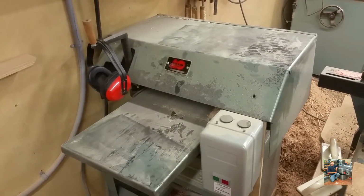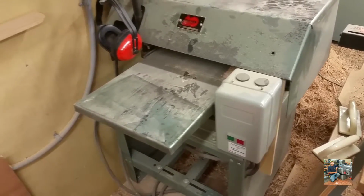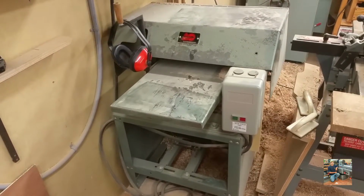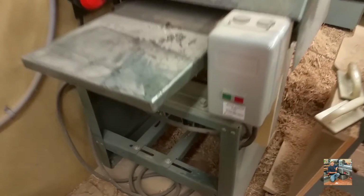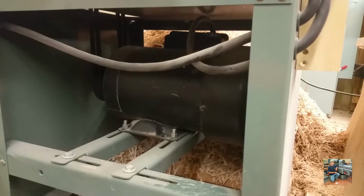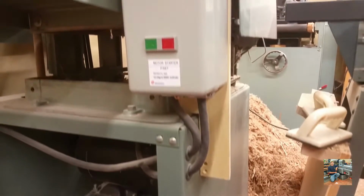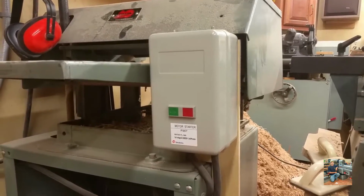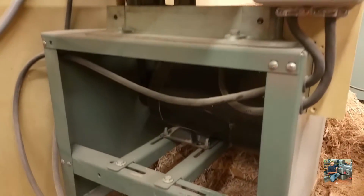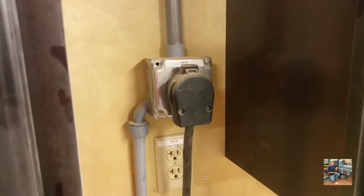I have a few videos on that. I'll put a link in the cards and in the description. But I ended up taking the motor off of my first Foley Belsaw and installing it on this one. I wired it up and put that motor here. It was still good. Ran my wiring up and around and into a magnetic motor starter. This runs on 220 volt single phase power, and I have it going to a welding plug in the wall here.